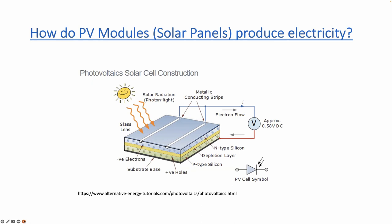For the rest of us, simplified analysis: voltage is like the pressure of pushing electrons. Electricity is simply the flow of electrons through a circuit. With the photovoltaic module — which is a PN junction with a clear tempered glass side and typically mounted on an aluminum substrate — when that photonic energy from the sun hits that PV module, it knocks those electrons free and puts pressure to encourage them to flow out the negative terminal to the load and back on the positive terminal.